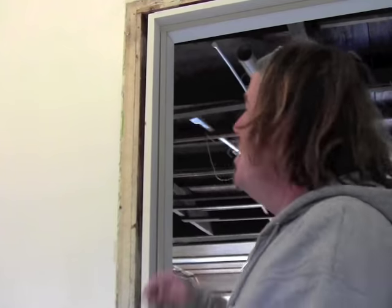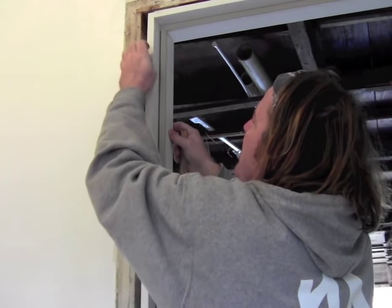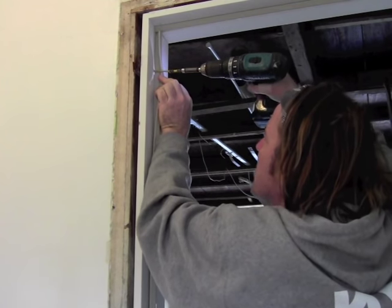Let's get some shims so we can do the strike side. I like to shim mine from the inside because here's where I'm going to be putting my screw — pull back the weather stripping and we can tuck a screw right in there behind it, securing the jamb. That way nobody sees the screws and it's good and secure. We're going to shim that top area. Once you get the shims to their little top, go ahead and screw it off. You don't want to over-shim and push the jamb out, otherwise your door is not going to shut the way it did. Secure it right through the shim. Screw is hidden. Now let's do the bottom — put the jamb where you need it, shim it, and screw it off.